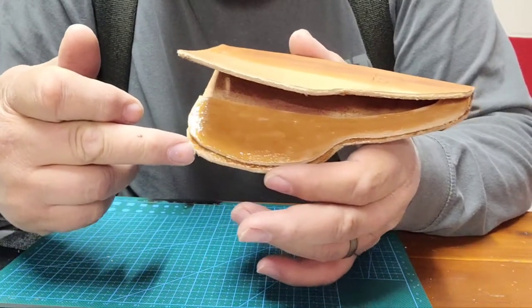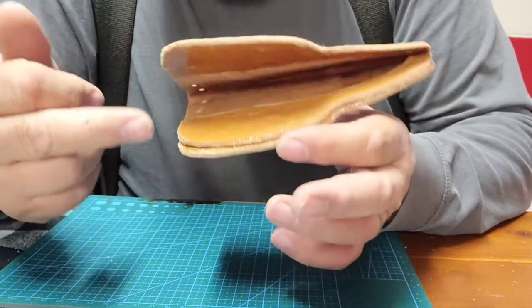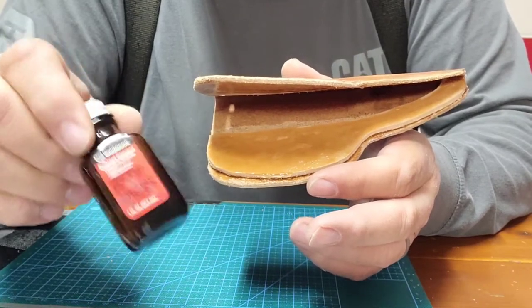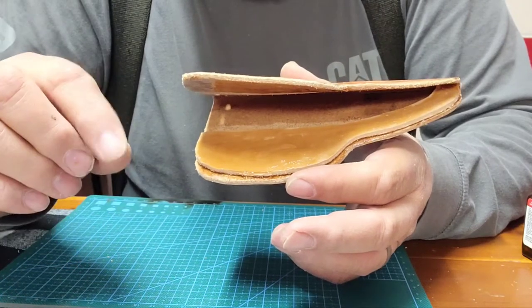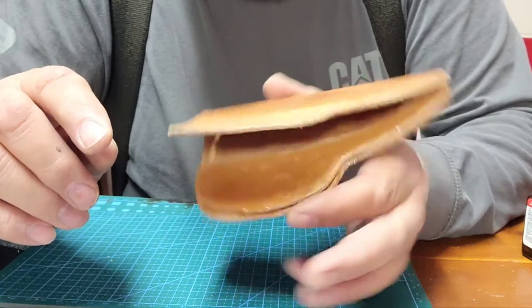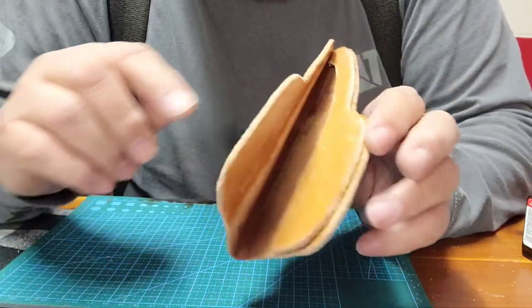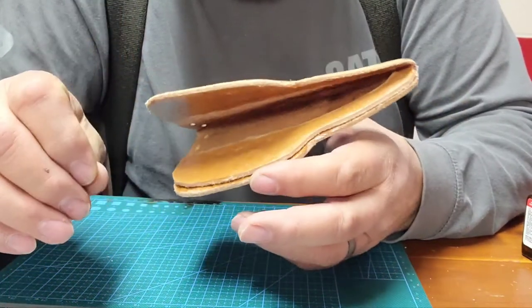We're a little long on the edge here and that's fine — we're going to trim that down later. This piece is down, and then we've got the other piece glued up with contact cement. Make sure you don't buy rubber cement — it's a different thing. You want to let the contact cement get almost dry to where it's just barely tacky, and that's when you want to stick it together. Be careful putting it together because you're not going to get a second chance. We start on one end and work our way down, making sure we're aligned on the edge.